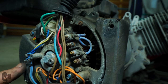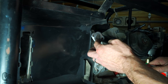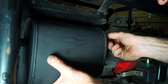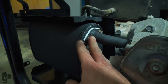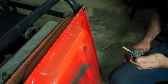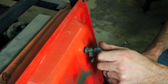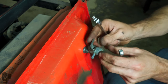That looks pretty good. We've bolted it all up now. I'm going to wait for the fire gum to dry overnight as the recommendations say, so we'll leave this and get everything else back together. The last thing we're going to check tonight is the fuel screen — basically just unscrewing the petcock or fuel shut-off valve. That little screen is attached to the valve and this one looks pretty clean. We'll screw it back in and now we are pretty much done for the evening. Just got to wait for the exhaust stuff to dry, then we'll pick up the rest of the repair and service in the morning.